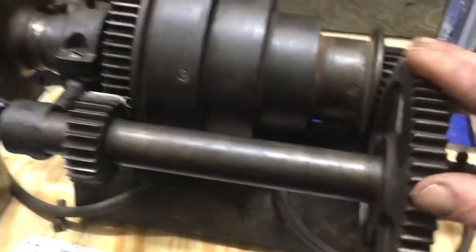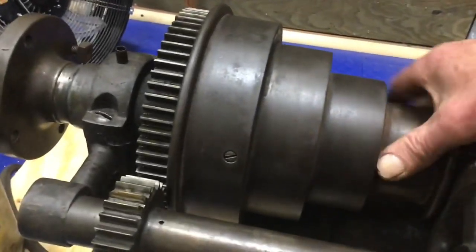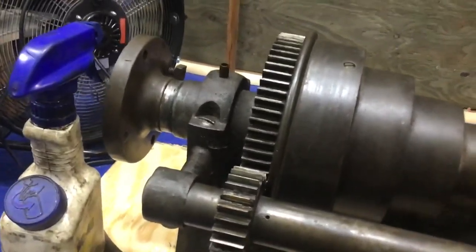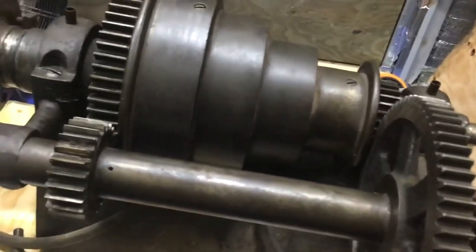I'm more familiar with making flat belts for flat belt machinery. I had a Warner and Swasey lathe and other old lathes years ago as a kid, and I had to make my own flat belt. I've got a flat belt headstock here — the one I showed in the video the other day. I'm just working on getting it lubed up; it's got dried-out grease. I just got it yesterday and didn't really have a chance to do anything with it yet, but I'll clean out the babbit bearings and make sure everything is good — meshing gears, back gearing.